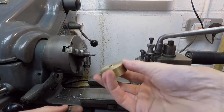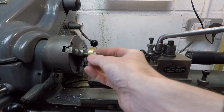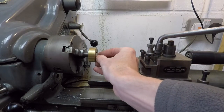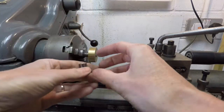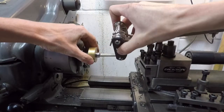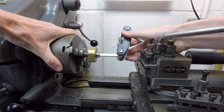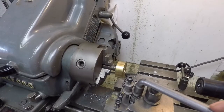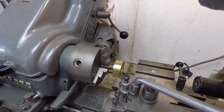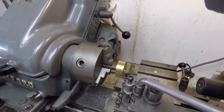I've put the flywheel on and I've got an M6 nut which goes on there — I should get a washer, I'll dig one out in a minute, but just to show you how it works. I've got a box spanner to tighten it up. What we need to be very careful about is we don't disturb the thing in the chuck, so don't do it too tight. So now we're up and running and we can machine the right hand face and the outer diameter concentric and square with the bore of our flywheel. And that is how the stub mandrel works.